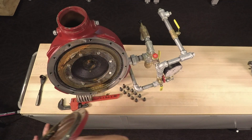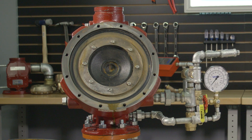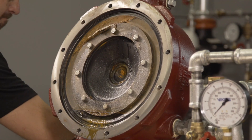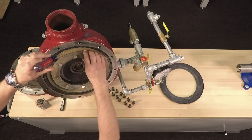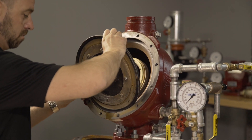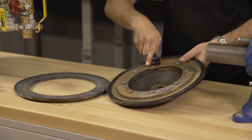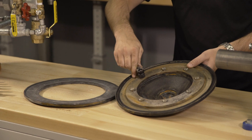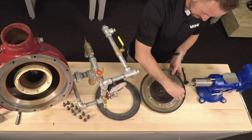The spring will also be removed with the cover. The clapper assembly is not bolted or screwed down into the valve and is assembled as a single part. To remove the clapper assembly, you will need to gently place a flathead screwdriver in between the body and the upper diaphragm. This will allow you to remove the clapper assembly. With the clapper assembly now removed, we can remove the hex head screws that are securing the clamp ring to the clapper and holding the upper diaphragm in place.